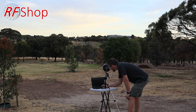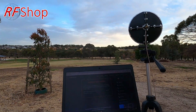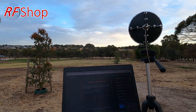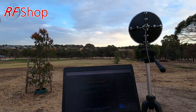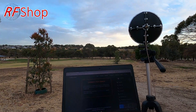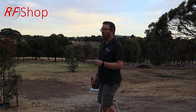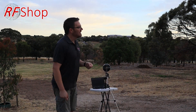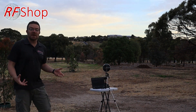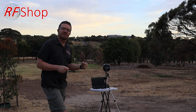It's not working. I just want to see if I can still see the presence of that network. It kind of can't see the network at all — it's not seeing the 3D printed antenna. There it comes up at the bottom — it's a 2.4. Of course, 2.4 GHz is a lower frequency so it propagates further, so you'll more likely get the 2.4 GHz frequency working over a longer range. But because we're trying to stretch and see how far we can go, I am specifically using 5.8 GHz.